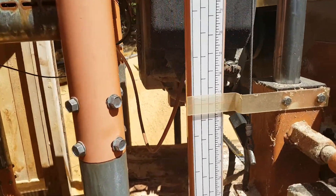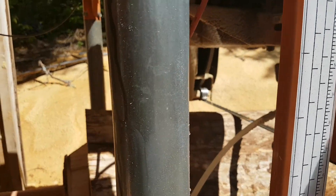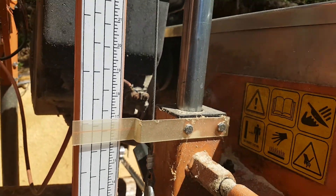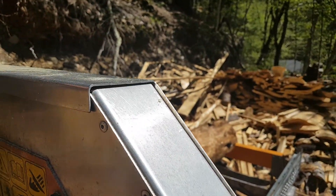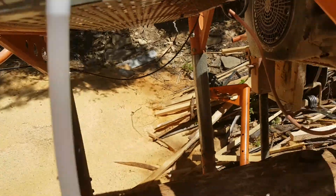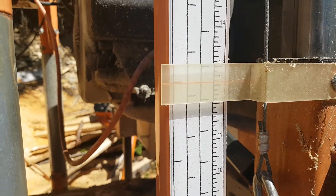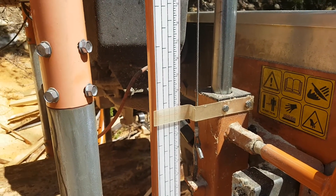So if we look right here at the scale on the side of this mill — I'm just inside the stump flare on the bottom of this log. You can see where that log flares up there a little bit. I've gone just inside that stump flare because that's just going to be waste wood anyway. So looking at this, we're at 16 and a half inches. Now if I travel the mill down to the other end of the log and lower this blade right down to the log, I'm at 12 and a half inches. So the difference in taper on this log is 12 and a half to 16 and a half — four inches.